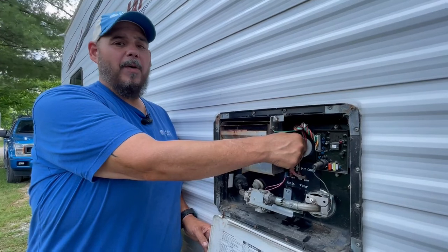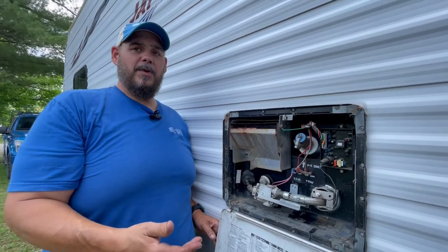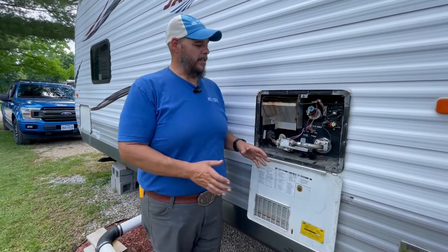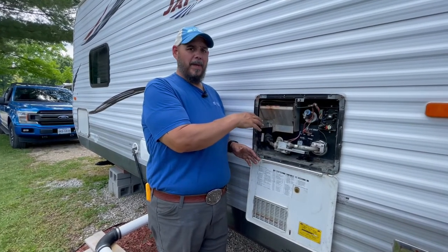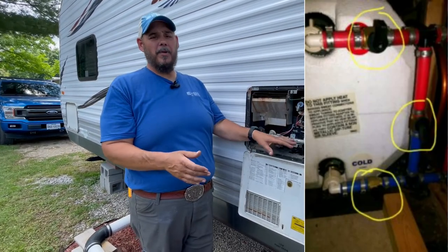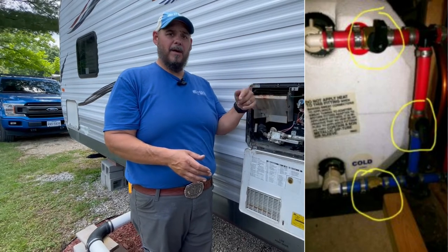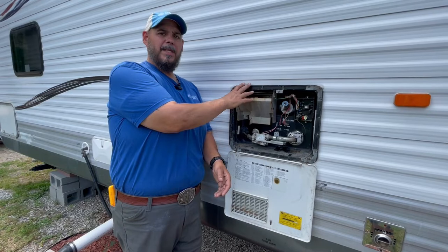So the next thing I do is go in and check what I've asked our customer to do — check their valves. Your bypasses could be in multiple places. On this particular unit, there's a cabinet inside in the bathroom with an access panel. You pop that access panel, and normally right behind the water heater there are two lines: a line that goes into the water heater and the line that feeds out. Those bypass valves are generally very close to this.